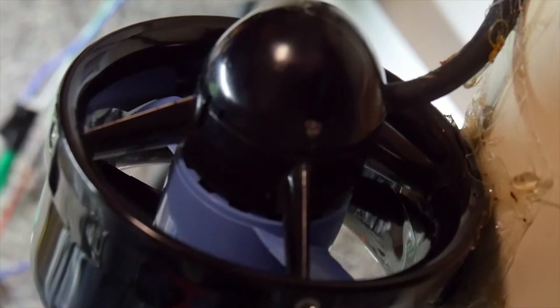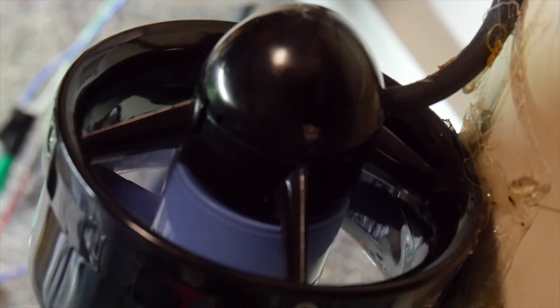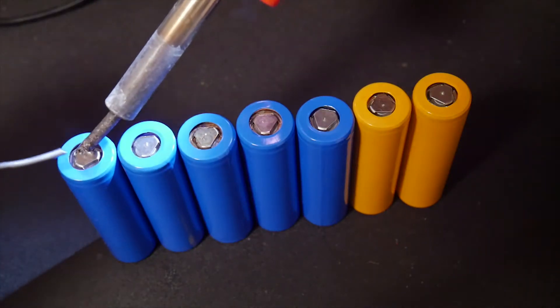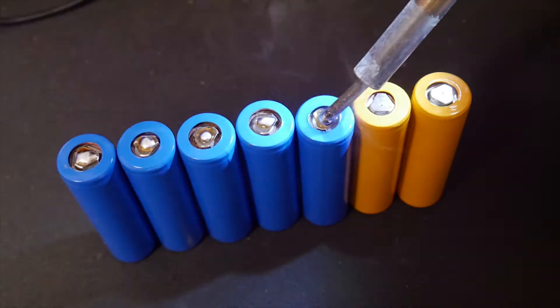For the motors, I opted for the T100 thruster, which provides about five pounds of thrust at only 130 watts. This is an incredibly efficient motor because it only produces one pound of thrust for only 26 watts of power. This means the entire journey will need a constant 50 watts of power if we want to stay at about one knot or so.